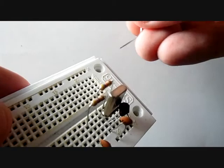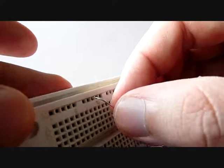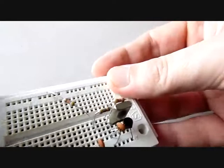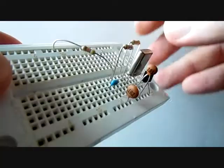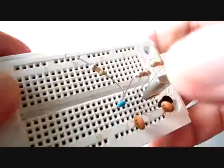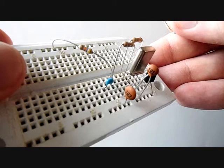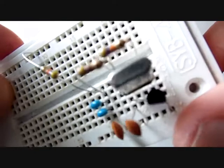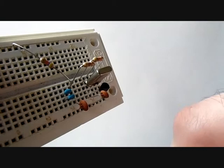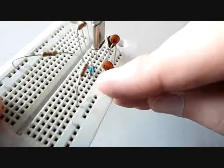The next part is the remaining 47k resistor — one lead here and the other wire on the other connector. Now we take both 100nF capacitors and place them in the circuit board: one belongs here and another one belongs below the other capacitor. Now we take the leftover 470 ohm resistor and place it on the circuit board. It is important that the contact is where the capacitors are.